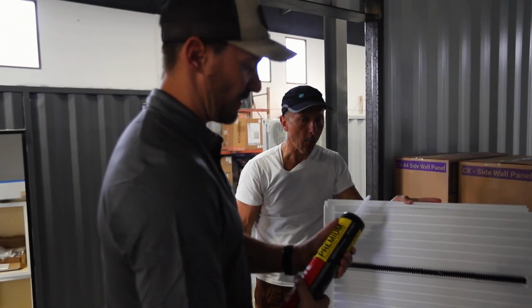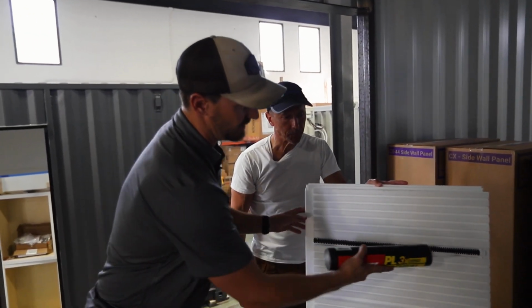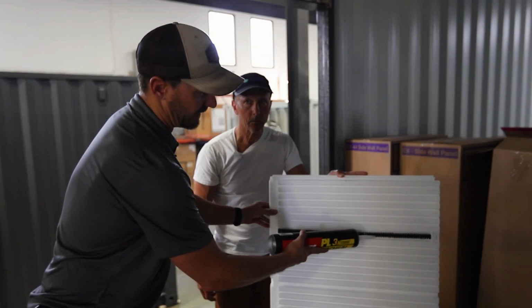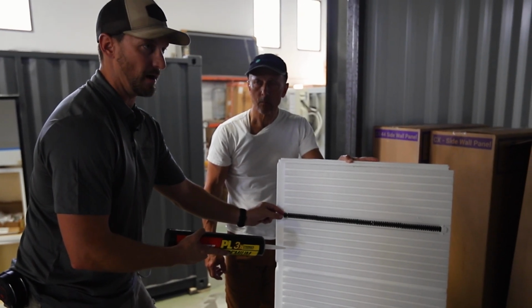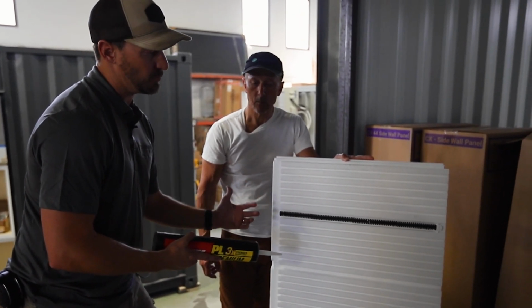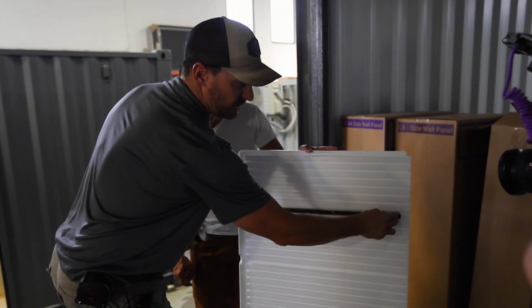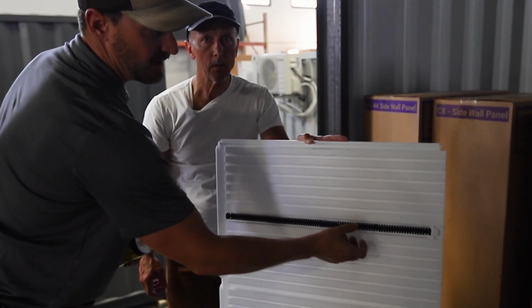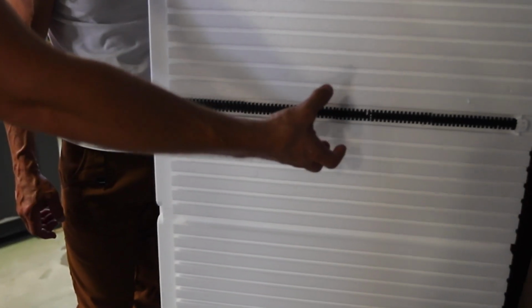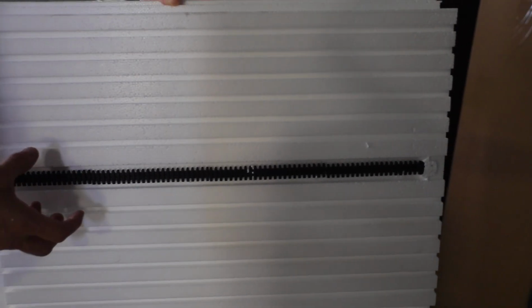Exactly, so that's one thing you're thinking about when you're putting this adhesive on here and it's stacking on top of this. It might look like you have a good amount of glue to bond to that surface, but as you push it into that wall, it's going to fill in this void around this composite stud, and it's going to be mechanically grabbing, like a mechanical fastener, around all these little plastic fittings here. And that's what your bond is.